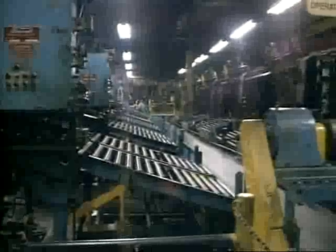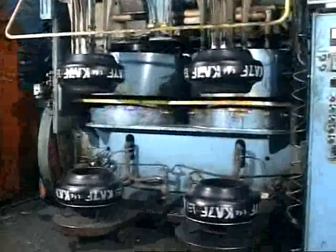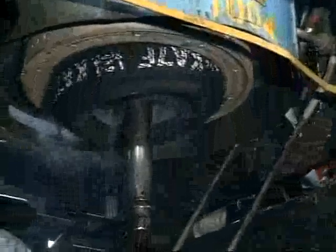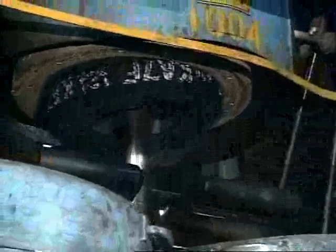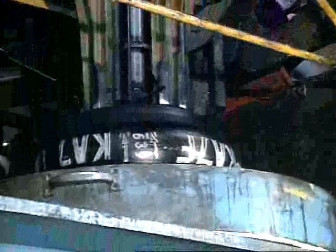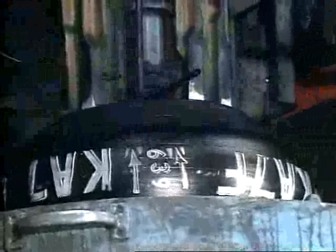That's taken care of here. The secret to making the tire durable is the vulcanization process. The tires are vulcanized by heating both the outside and inside of the raw rubber tire at the same time. This creates new molecular links in the structure that make the rubber tough while retaining much of its elasticity. As well as performing the vulcanizing step, these molds contain the tread pattern for the tire and the lettering that will appear on the sides — it's called sidewall literature in the tire biz.